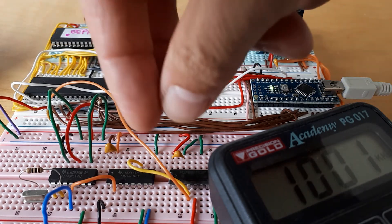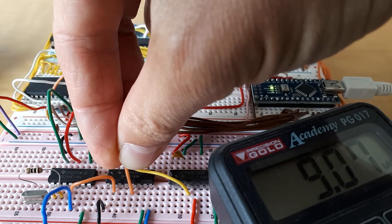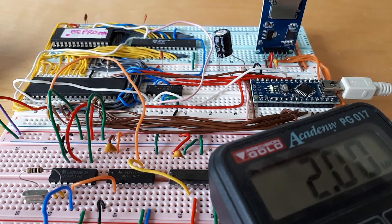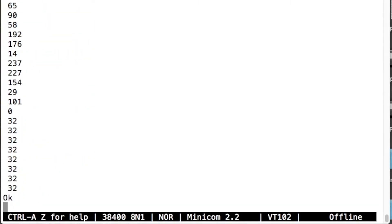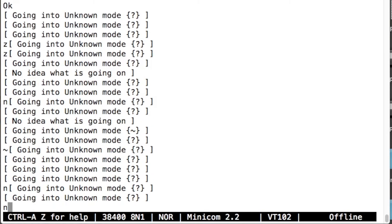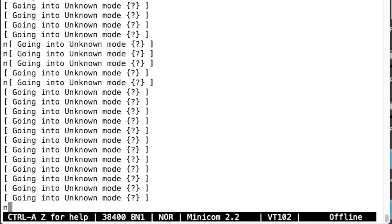That's at 1 megahertz. Let me see if I can find 2 megahertz. So I'm now trying to run it at 2 megahertz — it's still running — that's very fast — not too bad actually. It's actually working quite well. Let me find 4 megahertz. Four megahertz — let's try running at 4 megahertz. No, that's not working. I've completely crashed it — I have to reboot. And I've also found that it never boots up at 2 megahertz.